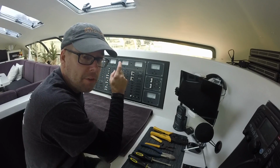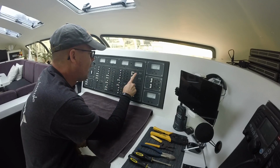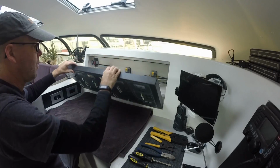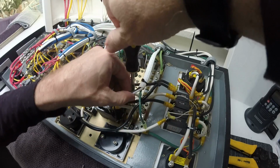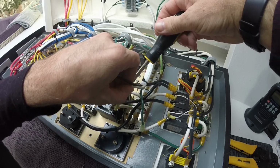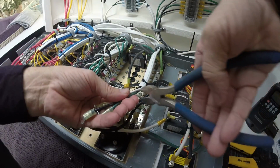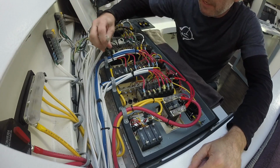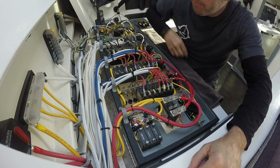Okay, now that we've pulled the 12 volt lead from the heaters over to the board, I'll get that wired into my 12 volt panel here. I'll remove that 110 lead from our old heater air conditioner at the same time. Okay, I've killed the 12 volt. Now it's time to direct my attention to my new 12 volt lead to that sub panel. It goes to this breaker here, so it's just a matter of prepping the wire and getting it installed.